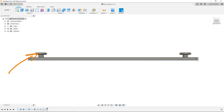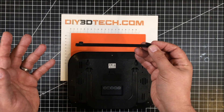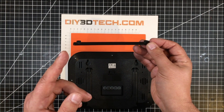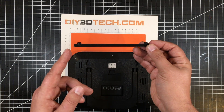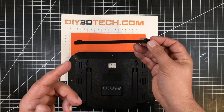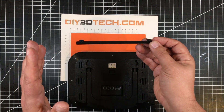The tops of these pins I also filleted to improve printability, because you will need supports. There is a bit of overhang and it's too much overhang to bridge directly. I did use supports, but the fillet means I can use less supports and there's less attachment. I would also suggest, if you're going to use Cura, add interface to the supports — it makes it a lot easier to clean up.